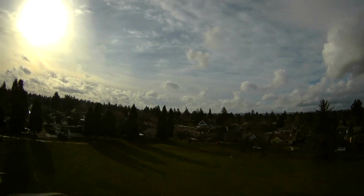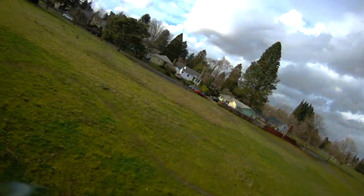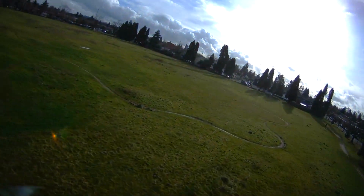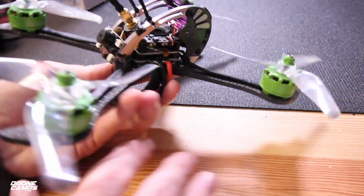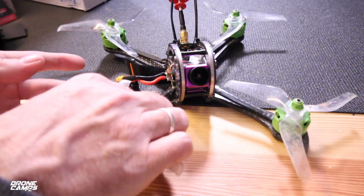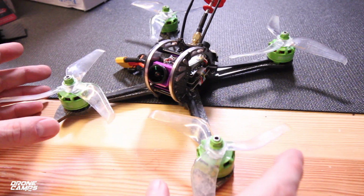So this is my first experience with this, and as you'll see coming up, I did have some issues with that piece of foam like everyone else did, and this 3M VHB tape really made a big difference securing that gyro and not getting that hard jerk to the right. Sort of just a gyro freak out. And the Betaflight tune on here was okay. It's not going to be perfect. I think it still needs a little bit of tuning for my particular model here.